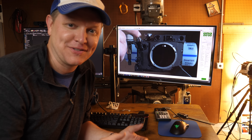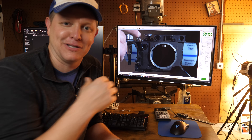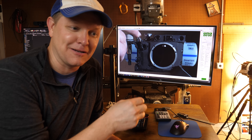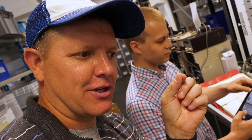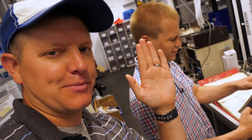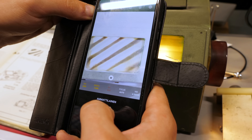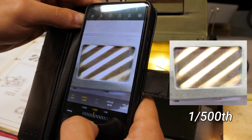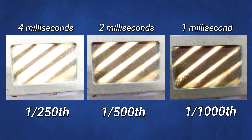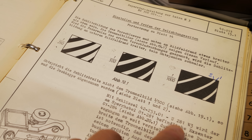Let's go back to the Camera Rescue Project at Kamera Store in Finland to see how we use this to measure a mechanical camera shutter to millisecond accuracy. Ari has a phone with an electronic rolling shutter. The difference is the Leica has a spring driving it so it has to accelerate and then decelerate the shutter, while the electronic shutter is linear. Can you change it to 1/250, 1/500, 1/1000? We can see the stripe getting wider as the shutter gets faster.